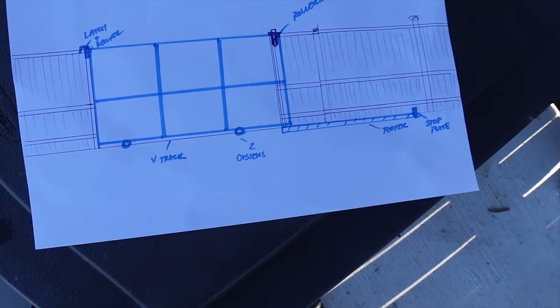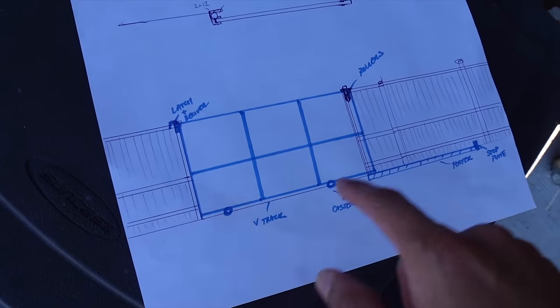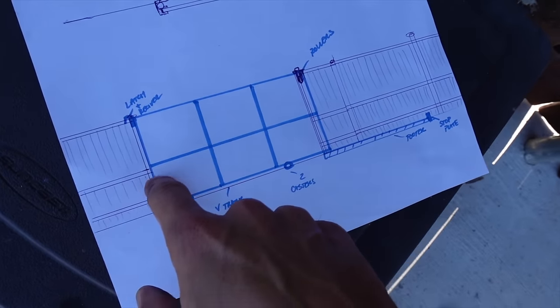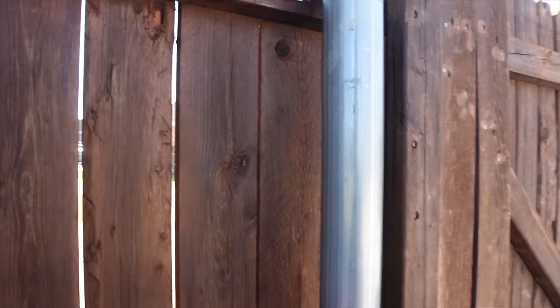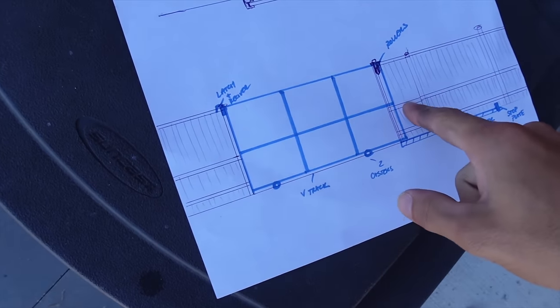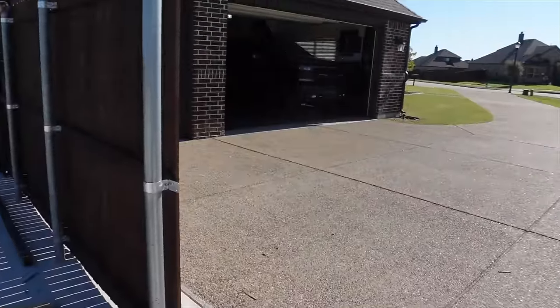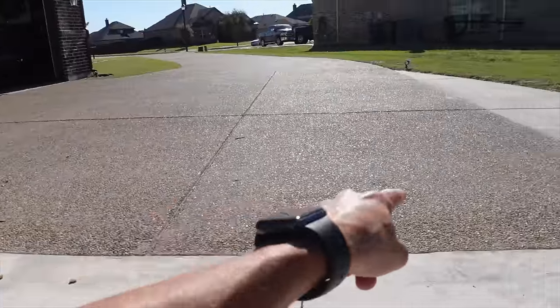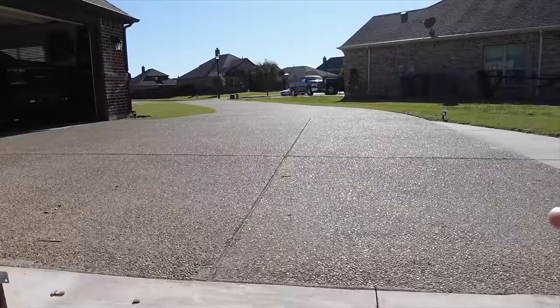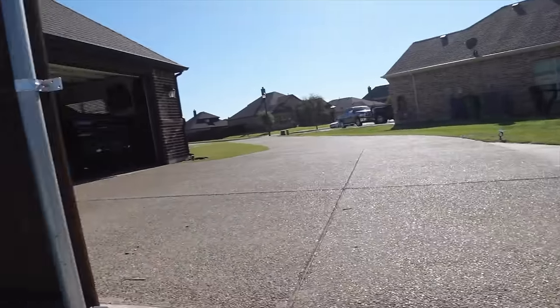Game plan for our gate — very basic layout. This is the rolling gate frame, going to be done out of our two-inch tubular steel. What I think I'm going to do is just a simple box and then run one across the center, because we're using these traditional fence planks and it'll warp really bad if there's nothing in the center. We're going to measure this thing out one more time. I'm not going to burn my new concrete, so we're going to go with the pebbled stuff, get it tacked up, make sure it fits, and then booger-weld the rest.